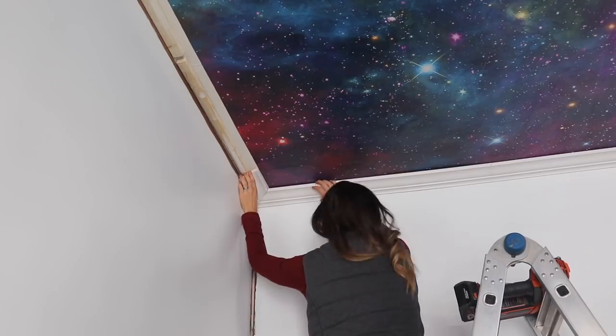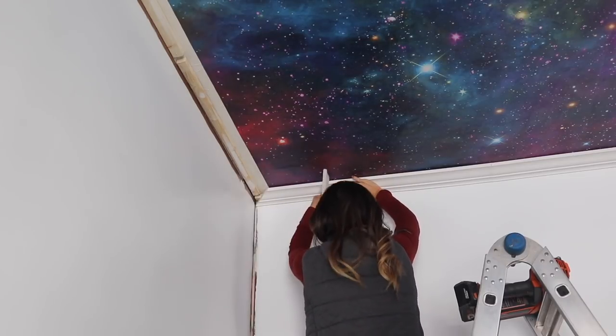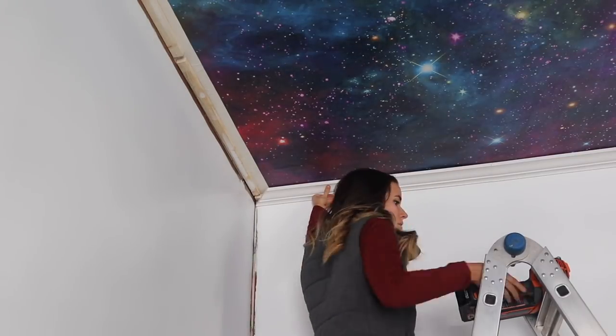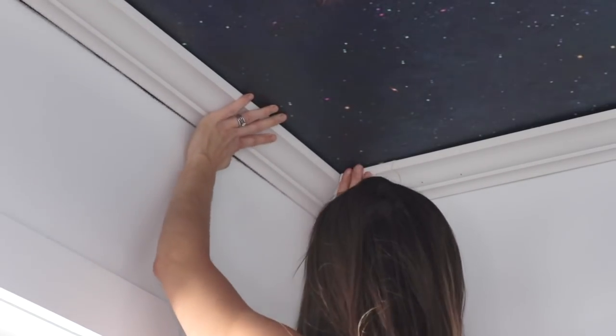This ensured the crown molding was getting installed across the whole room at the same angle, especially important because I was not installing at the typical 45. Sometimes shaving a little bit off the back edge of the molding with a utility knife helped free up space for the molding to tilt perfectly into place and get a nice tight corner.